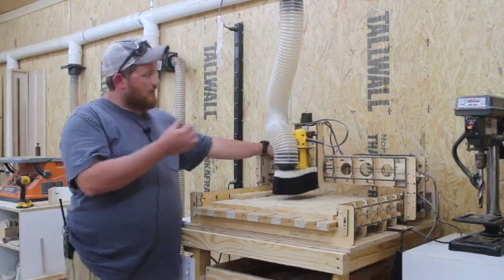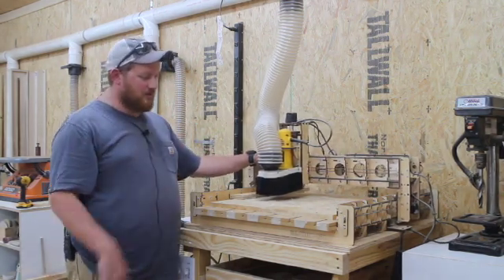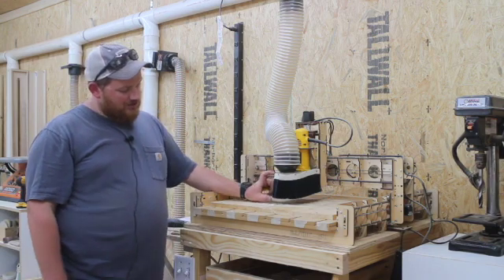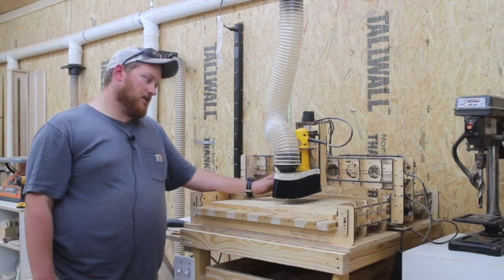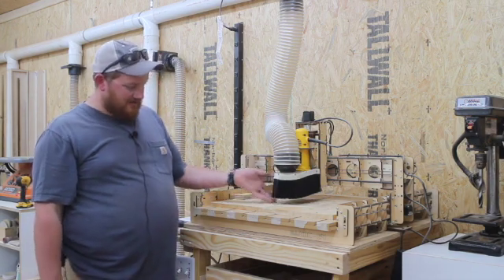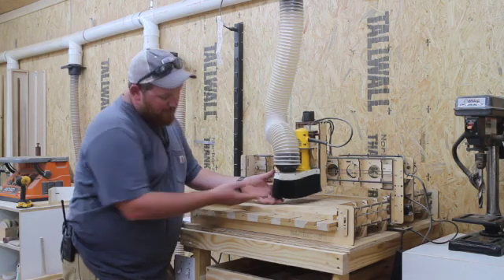As you saw, I've tested this to make sure there's no strain on the CNC — it's not having to force the hose around and it moves freely without any strain. This brush here will be a variable because it's a four-inch skirt, and depending on how long the bit extends out of the router, this might compress. If it has to get down to an inch off the surface for a small v-carve bit, these bristles are going to be pushed up and compressed.